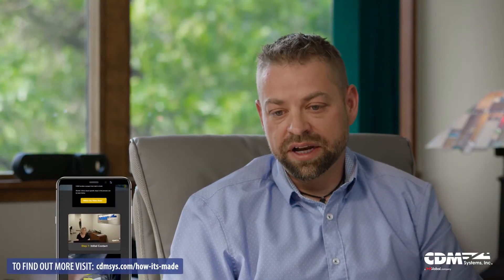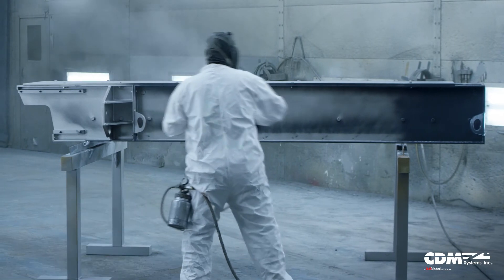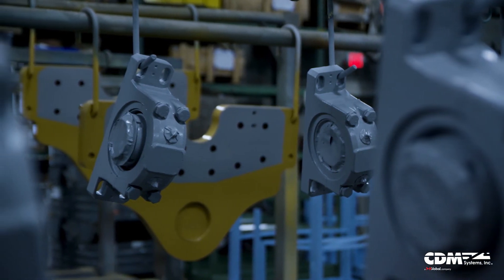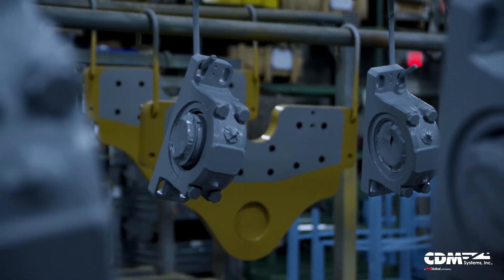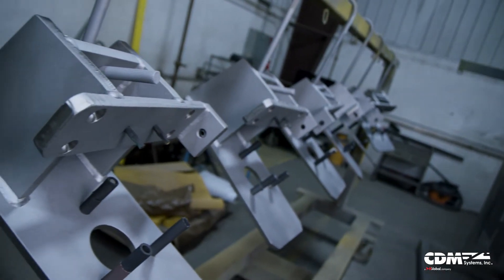Processes like that can take weeks. Say you have something that's highly abrasive in a highly corrosive environment — having the exterior provided with a marine grade, salt-laden, or very corrosion-resistant coating process can add years of life, while still allowing us to build the conveyor out of carbon steel or hardened carbon steel to provide that abrasion resistance for the internal components.